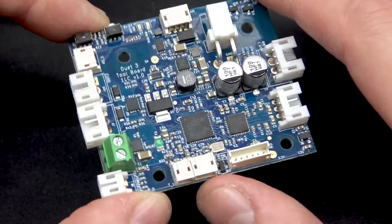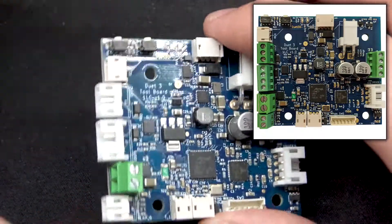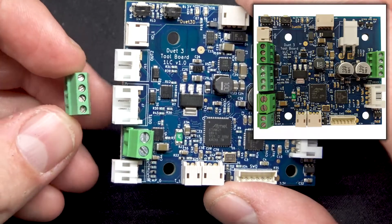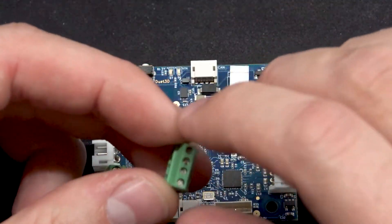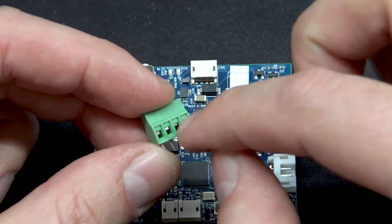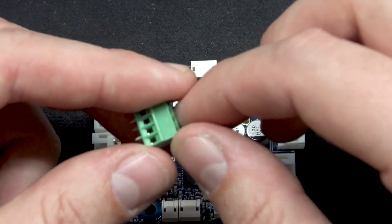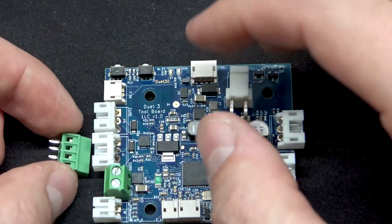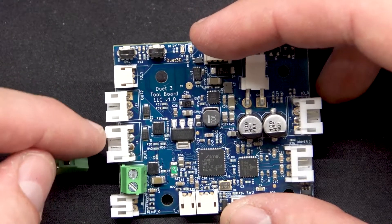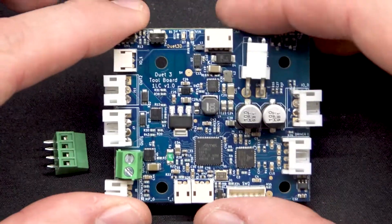I've done some changes, and comparing to the standard setup which comes with these Phoenix connectors — I believe that's what they're called — what I don't like about these is that they have really small screws and it's easy to break the connector if you screw on too tight. These JST PH connectors are really strong and they also have little holes for clasps, so you need to really pull hard to make them come loose.